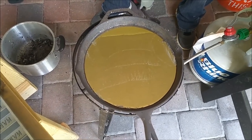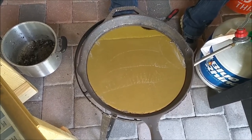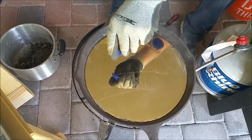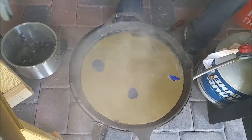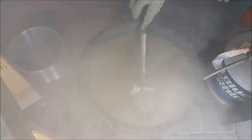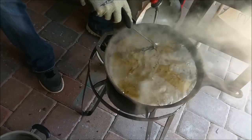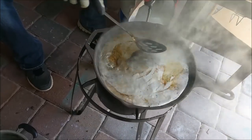We've got the skillet about as full as we want to get it. Got all the nasty residue skimmed off the top. Getting ready to flux it. This will bring all the impurities up to the top — last bit of cleaning — then some nice lead to pour into ingots.